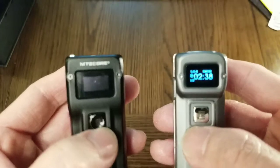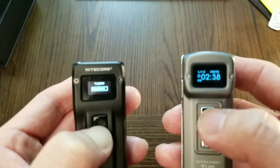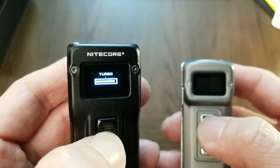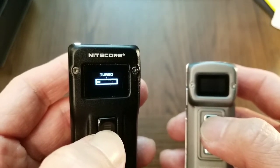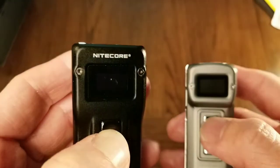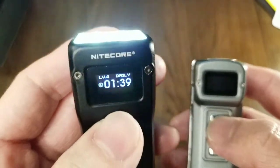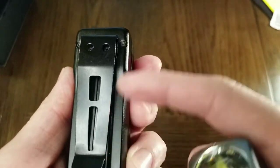To activate turbo on each, press and hold the top button. That's 4,000 lumens and you get 10 seconds. Press again and you get less than 10 seconds, depending on how hot the T4K is. As you can see, much less now. From 4,000 lumens it immediately steps down to 200 lumens, and that helps it cool down faster. Another thing that helps it cool down fast is the copper PCB inside the case.